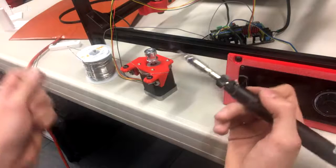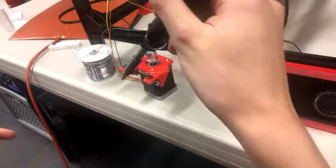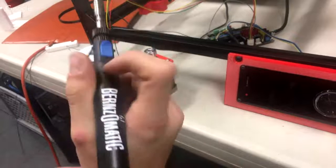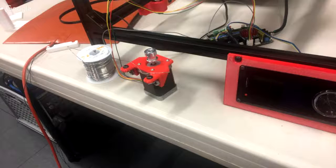Okay. If I change out the carriage later on, do I have to redo all the alignment? No, there's actually a trick for that. If you notice the holes that the cross rods go into inside the side carriages are deeper than they need to be. Yeah, so you loosen it up. And here, I'll actually show that, because someone else seeing this in the future would probably want to know. So hold on, let me work on that.